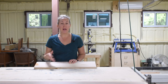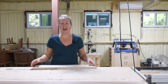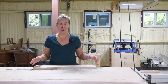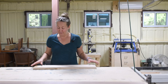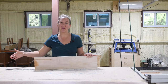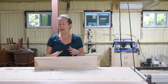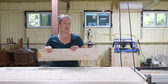Just be upfront with the lumber yard staff. Go talk to them, say hey I'm new, this is what I want to make — what would you recommend? Can you cut it down? Can I get it planed to the thickness I need? Most of them are very friendly and accommodating. A little tip: you don't actually have to buy a 10-foot board. You buy it by the board foot, so you can say I just need a 24-inch piece and only pay for what you use.